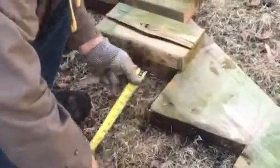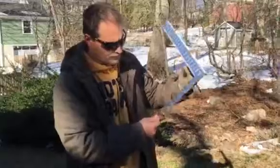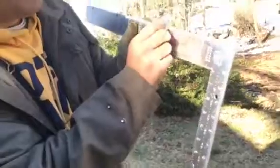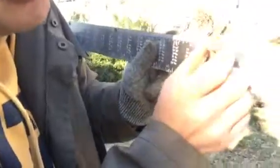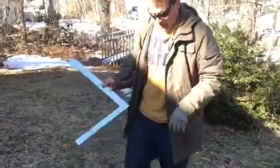Actually, this is probably six and seven-eighths. So what you're gonna do is take a framing square just like this — you want to set the height. You buy these at Home Depot, Lowe's, whatever — they slide on the square. So for the first step, we're gonna put it right at 10 inches there, then tighten it just like that. And this one here — we just measured it — I thought it was six and three-quarters, but actually six and seven-eighths. So you put it right there at the six and seven-eighths mark.